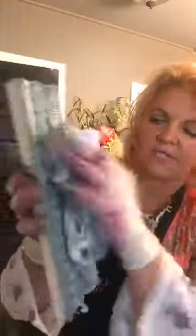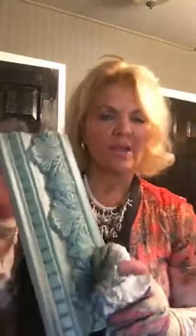I just brushed on a full coat, and now I'm going to show you how to remove it. I'm using a dry cloth and just going in here to remove it. I can dampen the cloth and get more off if I want. The heavier I want the effect, I use a dry rag — a dry rag is going to leave a lot more behind. Now I'm going to show you on a cabinet door that doesn't have a lot of detail. You can see that awesome look — this also gives a low luster sheen and another protective layer to your paint product.